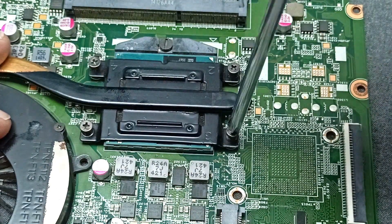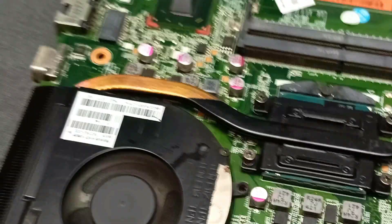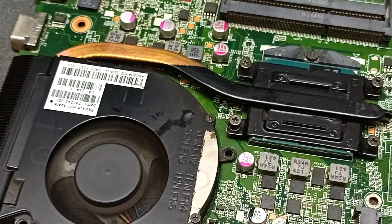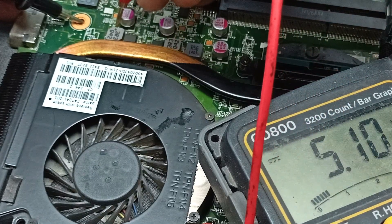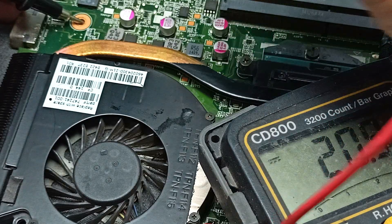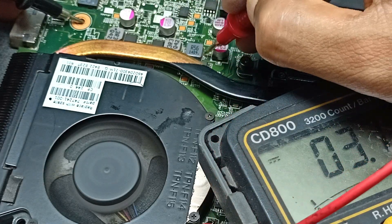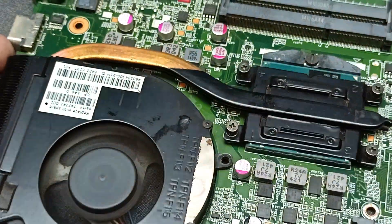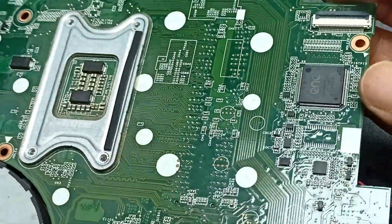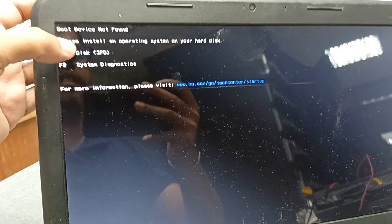I found the 2.2 ohm resistor is the problem. When I first checked it was good, but after replacing the IC and cleaning the circuit, the IC input voltage was not available. I saw it was open — this is the input voltage line of the IC. After replacing it from another circuit, it started working. Now 3.3 volts is available in the circuit. The 5 volt region is done. The processor voltage is also present and the fan is actually spinning. The main problem was that the resistor on this IC was open. Let's check the display — it shows 'device not found', but our repair work is done. Thanks for watching.